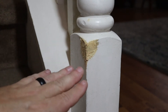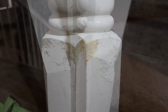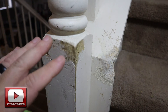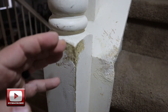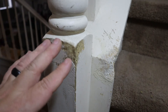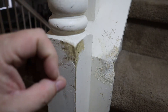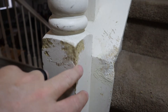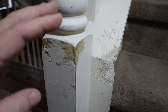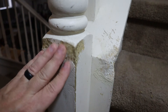Now that I've got everything filled, I'm going to give it time to dry. Once it sets up, I'll come back and sand it smooth. As for the more damaged area, it's obviously going to take more effort. I'm going to sand it down with some 120 grit — go a little more aggressive — and then do this in several applications, because it's so damaged. I'd rather do it in thinner coats; it'll make for a stronger bond and it'll just last better in the long run.